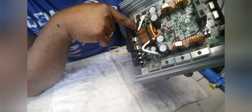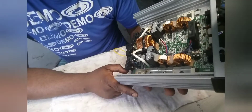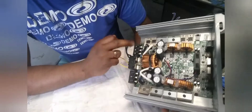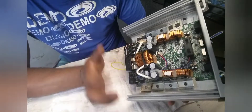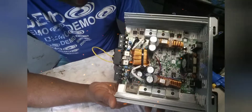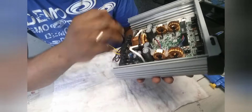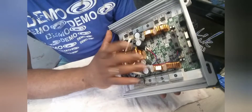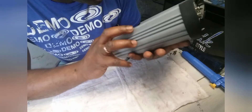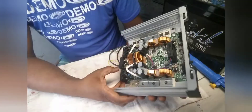Further inward toward the circuit and toward the heat sink there are some 10K resistors — those were fine, so I didn't have to replace those. The hardest thing was soldering these tiny little 10-ohm gate resistors on both sides — they were burnt. The power supply cap is 63 volts, 2200 microfarad, identical on each side. The rail caps — the power supply cap — is 4700 uF at 16 volts.